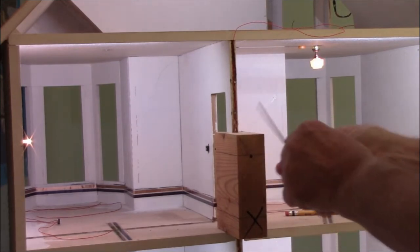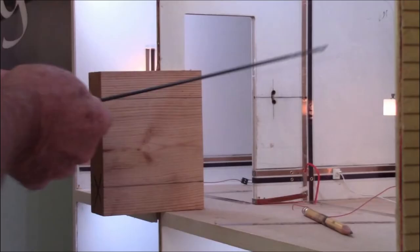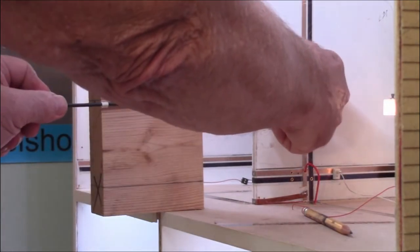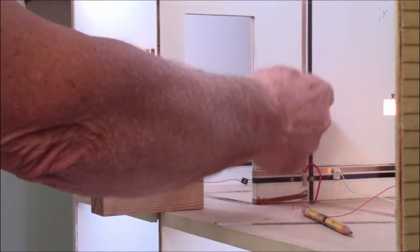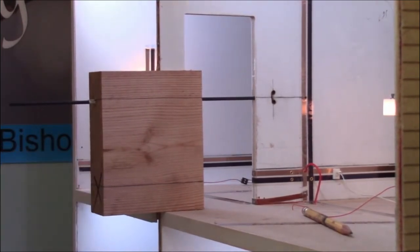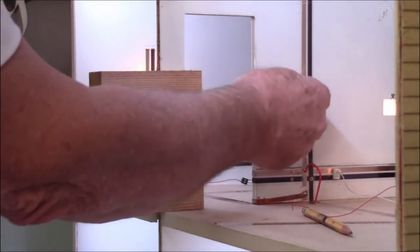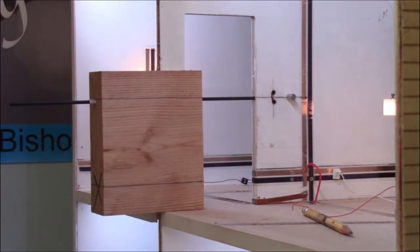The other thing is I have a piece of tape that I have put onto the drill so that I know where I need to stop, and I just measure the distance to where the drill is going to end to make sure that it goes past the electrical flat tape that's on the wall here where I need to have the hole come in. The other thing is we did on the first floor there, we take a magnet to find out where the drill ends. It works real well with this bigger drill bit, and it actually centers exactly where we are.